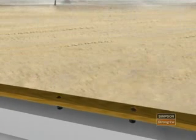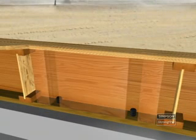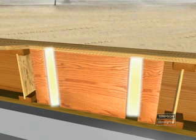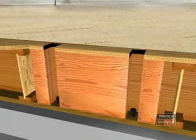First, install the mud sill over the SSW-AB anchor bolts. Install rim joist and solid blocking the full width of the strong wall above. Allow space for the threaded rod to go down through the subfloor. Next, drill a 2-inch hole or a 2-inch by 2-inch notch in the subfloor to allow for compression nuts.